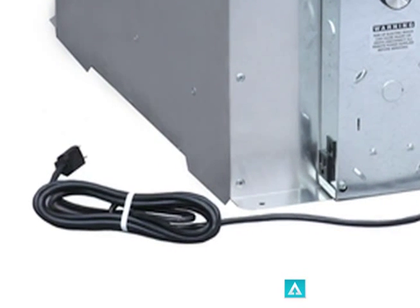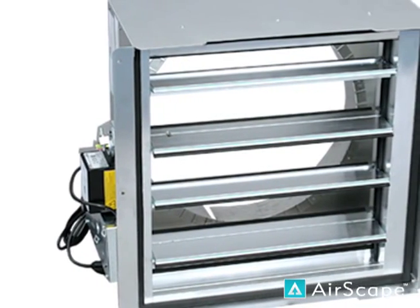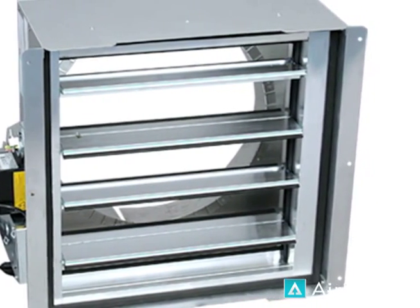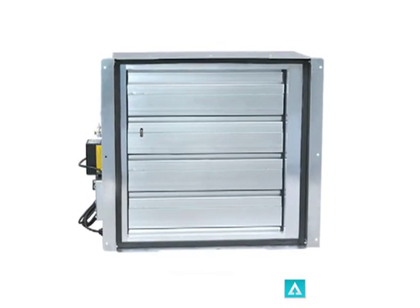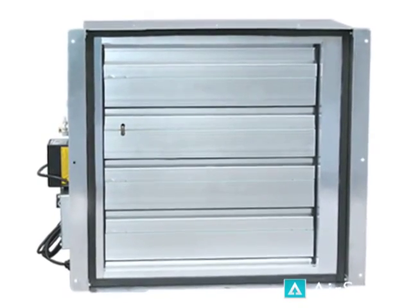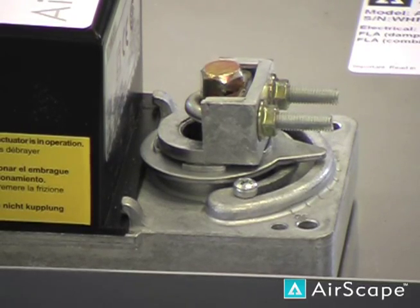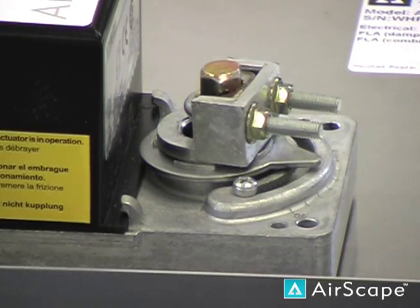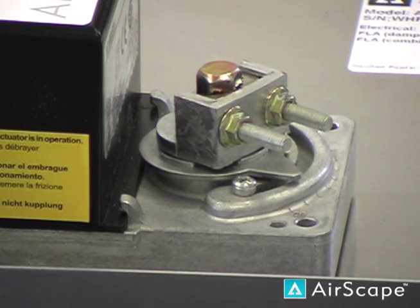The unit can also be hardwired. A key feature of the box itself are the automatic damper doors that function to keep a tight seal between your attic and living space when the unit is switched off. These damper doors are extremely heavy-duty, robust, and are widely used in commercial applications. The doors are powered by an industrial-grade actuator that will ensure a tight seal over and over for many years to come and does not require any maintenance.